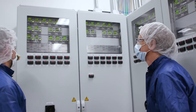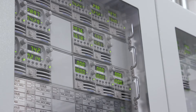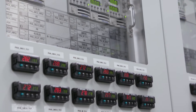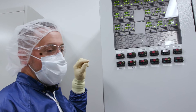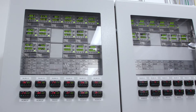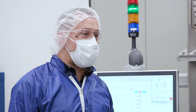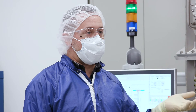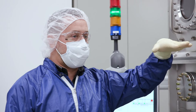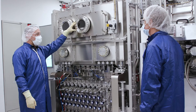Here you can see the temperature controllers and the power supplies that control the heat through the sources and the jet heads. Each printhead has four individual sources, but in principle we could have as many sources as we need to make more complex mixtures of materials. You might be able to tell from the location of the gas controls that our system is inverted compared to the poster, and we are printing in the upward direction with the substrate facing down. Jet heads are in the lower section of the chamber and the substrate is in the upper portion.